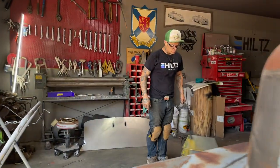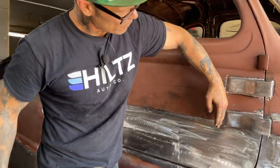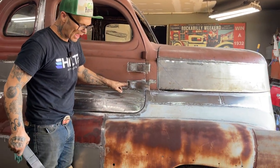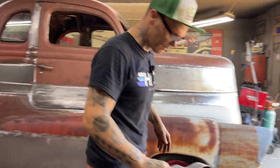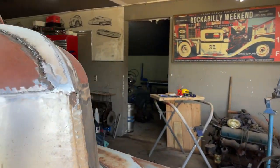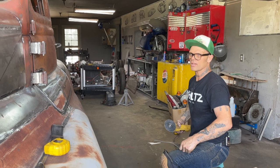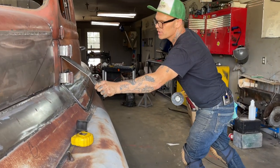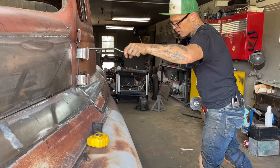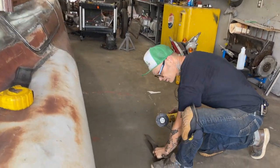So I did the exact same thing over here. I made them go straight up and down instead of making one shy or not. I just weld the plate on the inside on the door. Then I just bring this past it and weld it to the door. Just double strength. That's what I'm thinking. That's what I'm telling myself when I'm doing it. When I'm doing this sort of stuff, I have to ask myself all the time whether I think it's going to be strong enough. And I feel like being welded on the edge of the door, gusseted from front to back, and capped so that triangle cannot move, is going to be lots. That's what I have to ask myself and talk to myself.